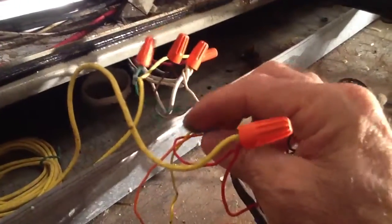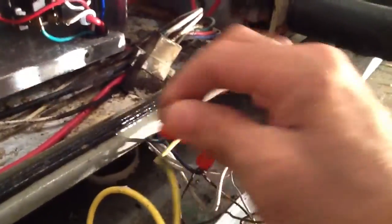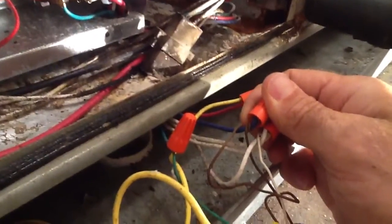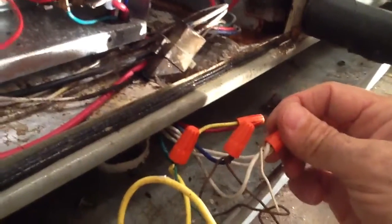You see the green wire? The green wire in this case is tied to the green wire going back to the air handler. You see the common wire? The common wire is industry standard blue, and they've used brown as their common both here and at the heat pump. That's why you have two wires.